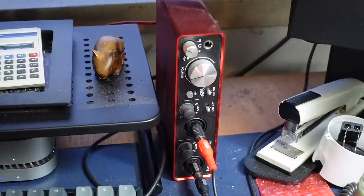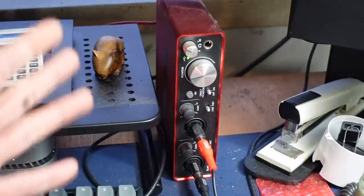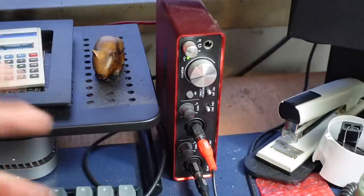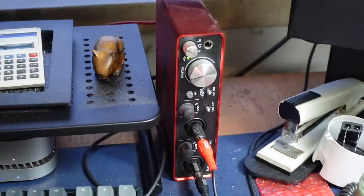I'm going to record the audio in 44.1 kHz, 16-bit CD quality audio, basically, and going to overlay that on the picture output. And I'm going to change between the different C64 models and make a little display on the screen which SID configuration you're listening to currently. And I chose three different demos that I particularly like and already know how they are supposed to sound on a regular C64. So it's easier for me to tell the difference, I guess. Hope you can tell the difference with my test setup here.